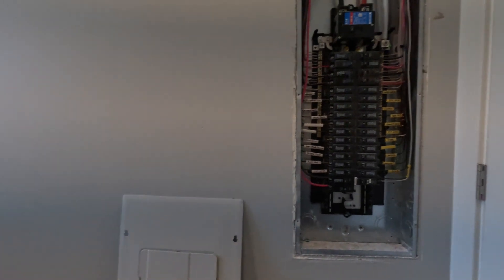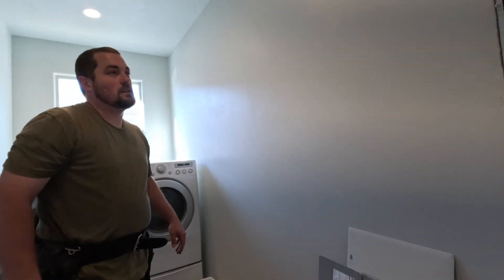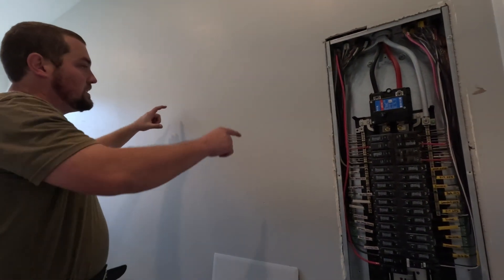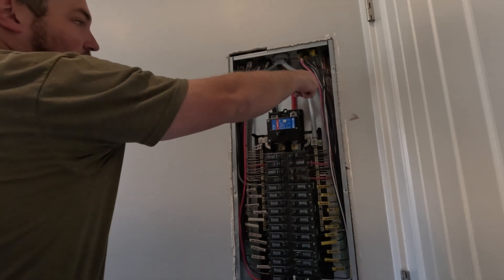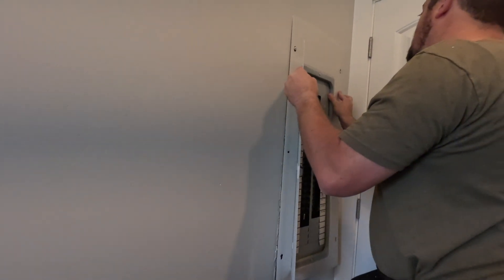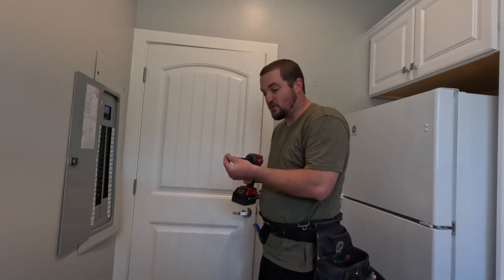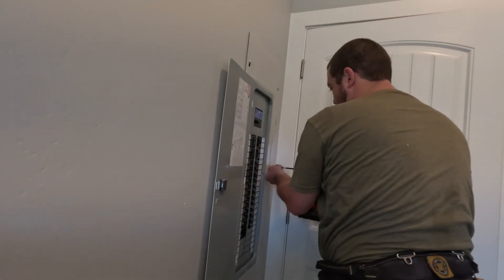With this breaker it's got two breakers because you're getting 220 volts and the phases are offset — well, your house is actually single phase. Even though there are two legs of power, in the transformer there's a single coil of wire with a center tap. So it's one side of the coil, the second side of the coil, and the center of the coil — that's why it's only one waveform. Three phase has three separate coils in either delta or Y configuration. There's also a two-phase system but it's kind of the unicorn — just a rumor.